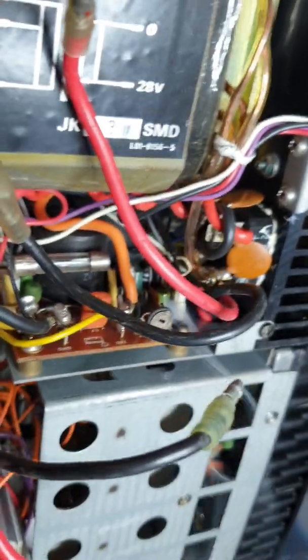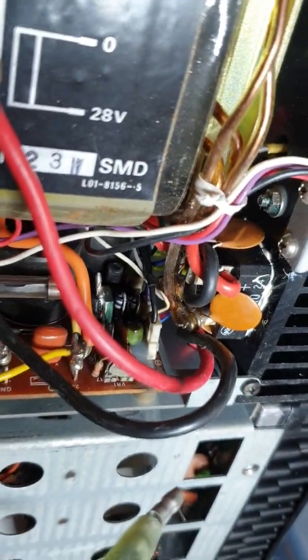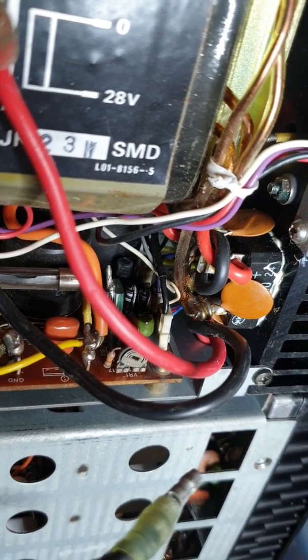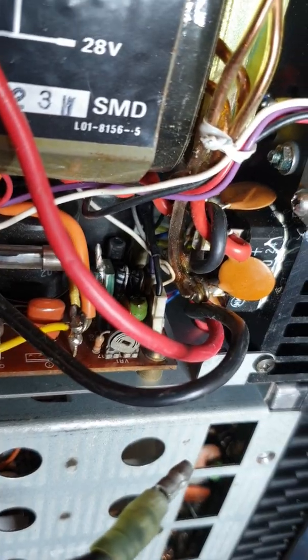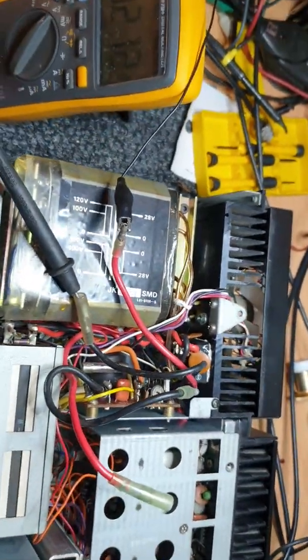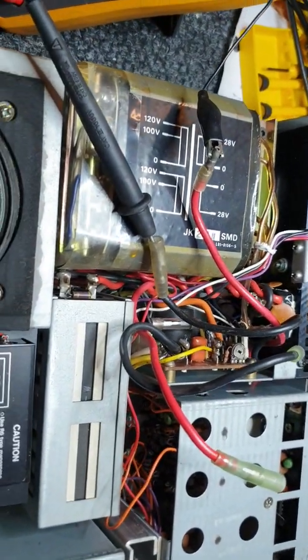Now, you might think — what sort of madness wants to get involved in watching something catch fire? But that can save me a lot of time — I can see what's gone. There's a little 1N4004 diode in there that's lighting up, and it's not very healthy at the moment. I'll just see if I can pull this board out easily.